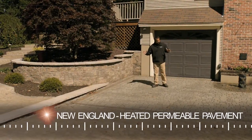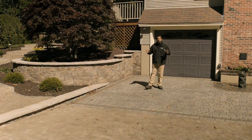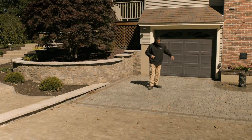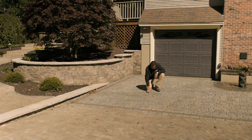I'm standing on what I believe is North America's first heated permeable pavement application under vehicular traffic load. There's also a harvesting component you see over here to my left. The sensors for the heating system are right here — we installed them about a quarter inch low so they wouldn't be damaged with the vehicles leaving and entering that garage area.